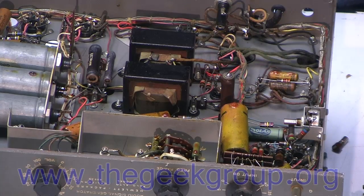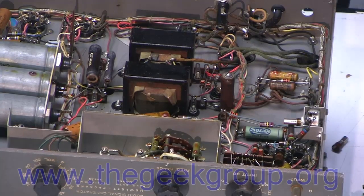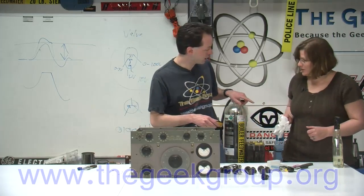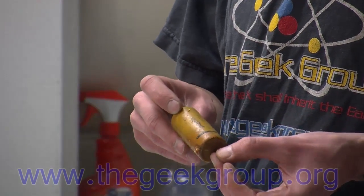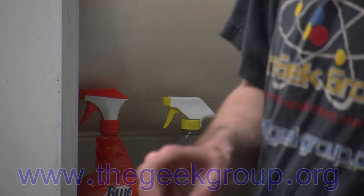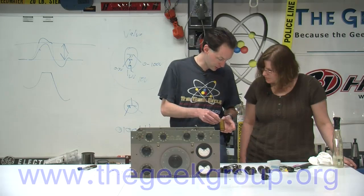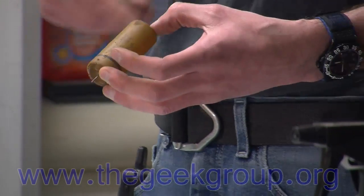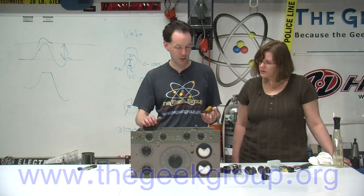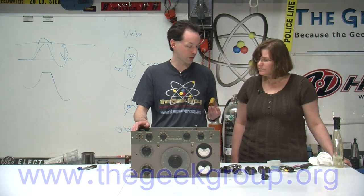There's something here I've never seen before — it says 'mica mold' and has an arrow on it, so maybe it's a diode, but it's got three colored dots: orange, black, and white. There are spaces for six dots. I have no idea what that is — if you know, please comment. It might be a capacitor, it might be a diode. A common failure mode in older gear is these capacitors — they're like a tube soaked in goop, probably beeswax. The capacitors will dry out. This one says 0.5 microfarads DCWV 600 — a half microfarad 600 volt, made by Aerovox in New Bedford, Massachusetts. They'll bake out over 20 or 30 years with all these vacuum tubes making heat. This thing is probably twice as old as I am — it could go back to World War II. But the cool thing is you can replace these pretty easily.